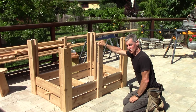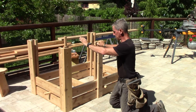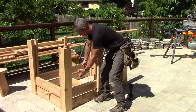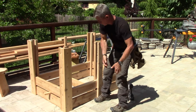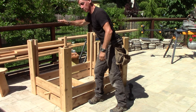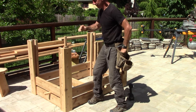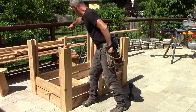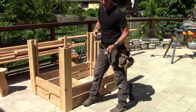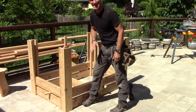The center stile here is the key, because what we're going to be able to do is make a panel for this section, so the customer can lift the panel out, work the compost, put the panel back. There will also be a hinged lid on top of here, which we'll get to in a second. Side, back, side will be a box. Now, they don't have to alternate box joints because, well, you can't see them, can you?